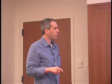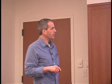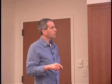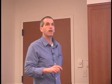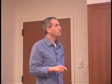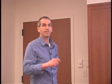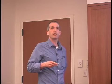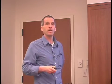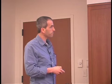We direct light from this group of heliostats to this receiver. This group of heliostats will direct light to the next receiver, and so on. At each time of the day, we check which are the most efficient heliostats, and only then direct light to the receiver. This is what we call dynamic receiver allocation. So the receiver always gets light from the most efficient heliostats, unlike in a large tower configuration, where heliostats have different efficiency throughout the day. In total, their efficiency is less than this configuration.